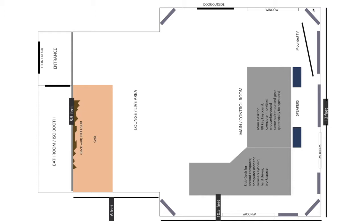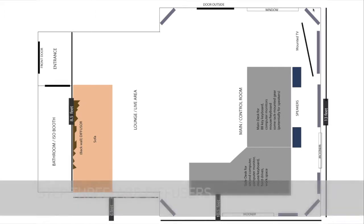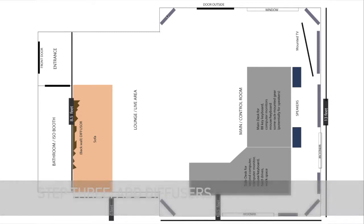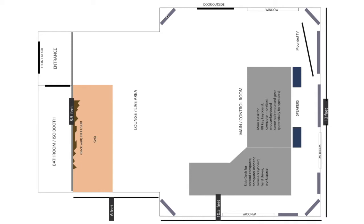Step number three, and the final step for me, is adding some diffusion in the room. So far, all the material I've talked about has been absorbing material — the acoustic panels are going to absorb the sound as it hits the wall, ceiling, or corners. We want it to absorb that sound so we don't get all these reflections blasted back at us. At the same time, it can also start to deaden up the room a bit. Placing diffusers — and if you look on the left side of the diagram here, this is my drawing of a diffuser — creates a little more openness and air in the room, because as sound hits each one of these shapes of the diffuser, it sends that sound energy off in a different direction.